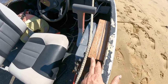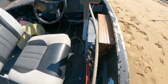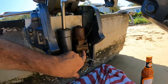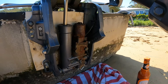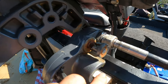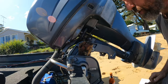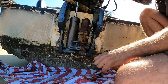When I went to mount the forward controls, I noticed that the mounting bracket had been cut off — the aluminium bracket. Evan's made a new timber one, looks really sweet. I've also put a little blanket here to catch any bits that might fall. There's a little connecting spline between the pump and the motor, and sometimes it sticks to the motor and can drop as you lift it up — hence not even attempting to do this one over the water. Beach the boat at high tide, do the job at low tide. Over here there's a little pin that when the engine's trimmed all the way up you can push in to stop it falling, but it's pretty rusty too. I might just find a stick and wedge it in — a nice bit of driftwood should do the job. The allen keys are 5mm.